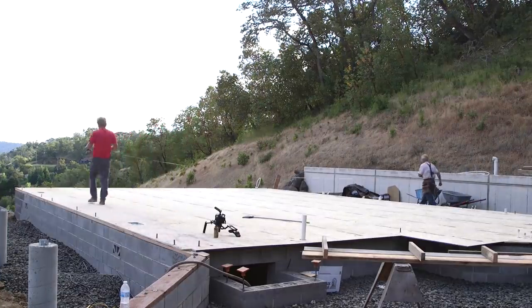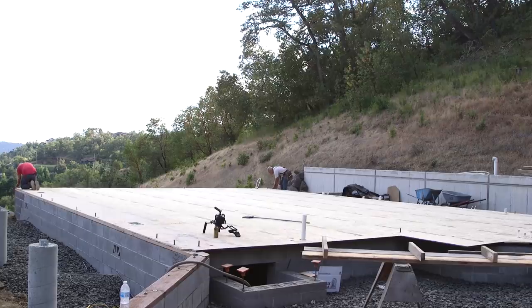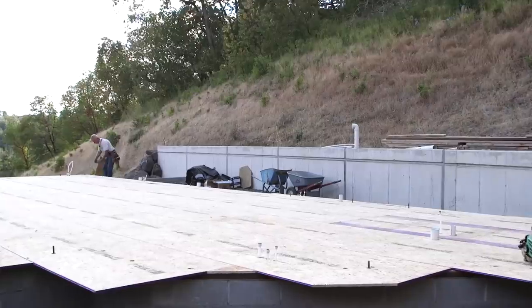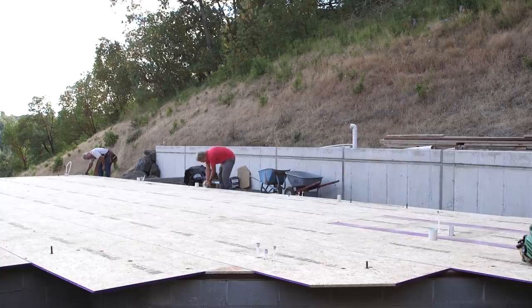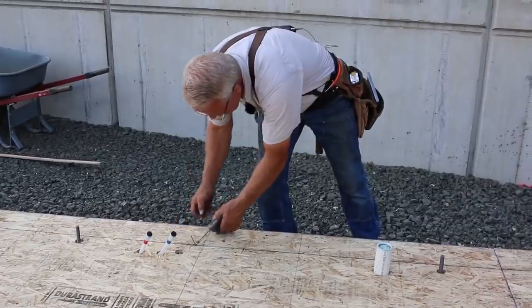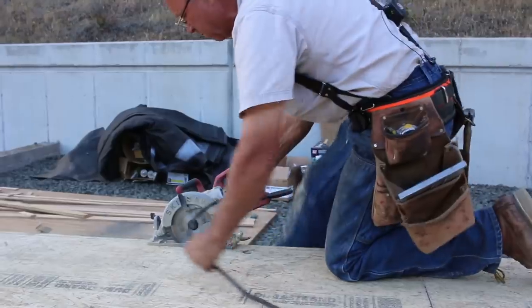If the footprint of your deck is more complicated than ours, dust off your geometry skills, pay attention, and make sure that all of the angles and all of the projections and all of the insets and the pop-outs are cut square, parallel to the primary square lines that we establish right off the bat.